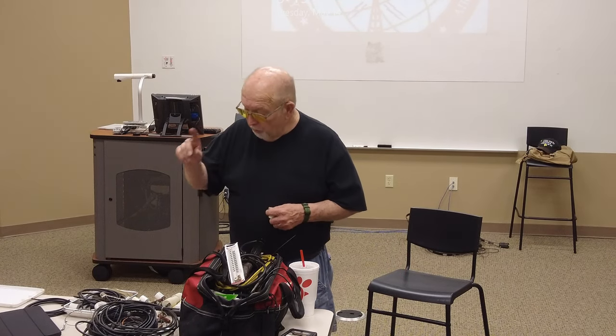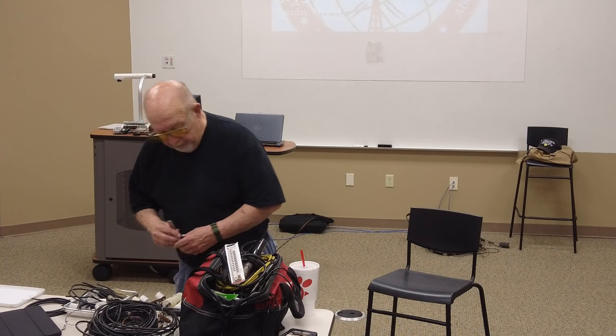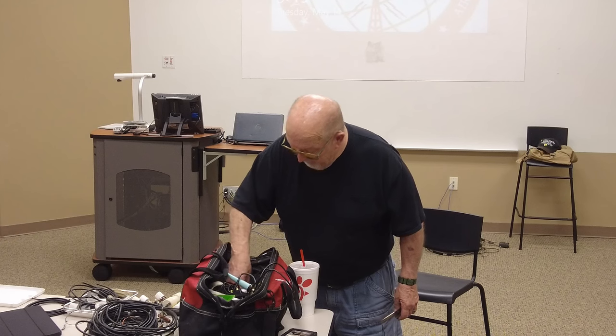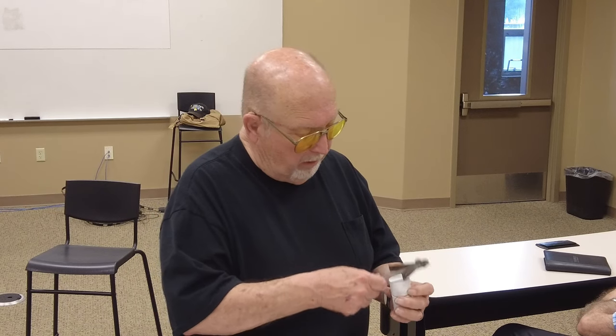Now, when you're building, this is something I definitely want to show you. This will be the last thing, we'll adjourn after this. How do I get the hole in the middle of here? Have you ever looked at an engineer's square set, with the square, and you see this crazy looking thing? That's how you do it. Put it in there, draw your line, 90 degrees, draw your line. Where they intersect, that's where you drill your hole.